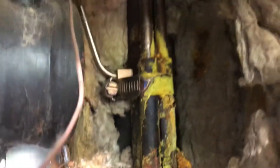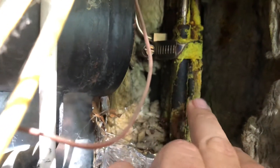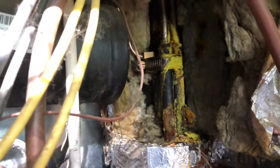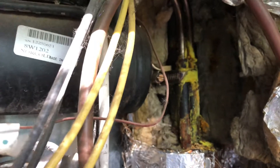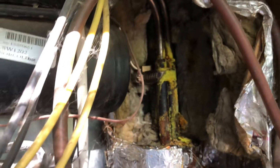So this one here, we found that it indeed does need a new cooling unit. As you can see it has lost everything. You see all this yellow stuff here? That is bad. If this thing was not inspected and somebody just reset the high limit switch, it's just going to trip again, or even worse it can cause a fire if the high limit switch doesn't do its job.